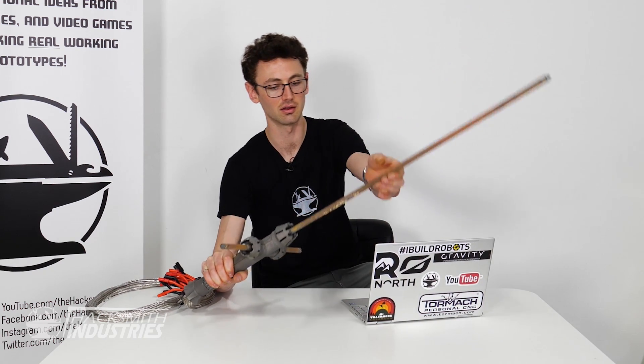An example of this is take an ice cube and just try to cut it with a butter knife. The butter knife is hotter than the melting temperature of the ice cube, but it's very difficult because transferring that heat takes a while. Same goes with this while cutting anything — even though this is hotter than the melting point of steel or aluminum, it takes a lot of energy to conduct that heat into the metal.